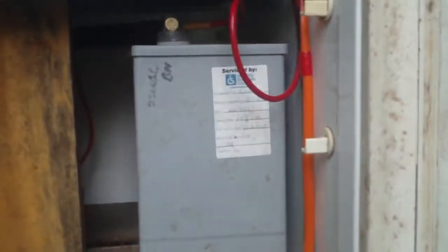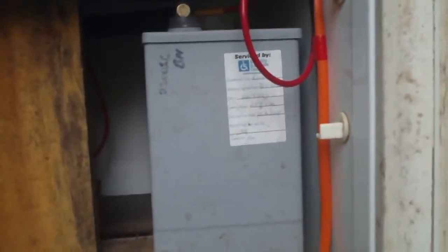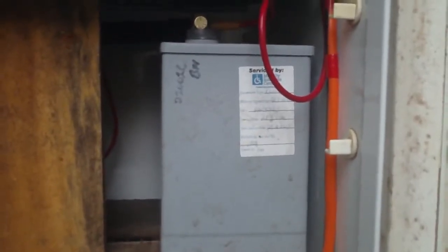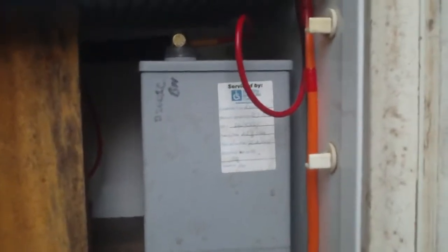They're not completely stuffed. They are not that great either, but they do work, you know, so they've got some capacity left in them, although not as much as I would like, and obviously not as much as those red ones that I swapped in and swapped these out. So I thought I'd move them into the battery fridge and beef up the battery fridge a little bit. So these of course are wired in series, and they're wired in parallel with all those flooded ones up there.